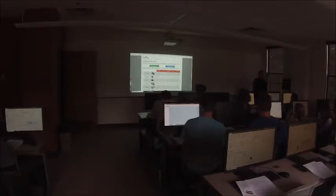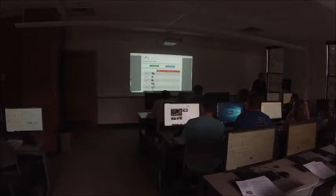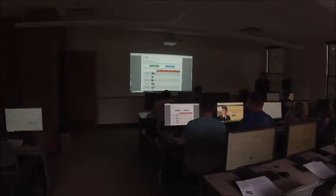So this website here is a website that VEX Robotics put together a couple of years ago. And basically what they did was they took a whole bunch of motors that are really common in FRC. They sent them out to a third party, I assume, for testing. They hooked the electric motor up to a machine called a dyno, which is similar to a chassis dyno or an engine dyno for a car, basically how they measure power output for engines, and they do the same thing for electric motors. So they hooked it up to a little motor dyno, did a bunch of testing.